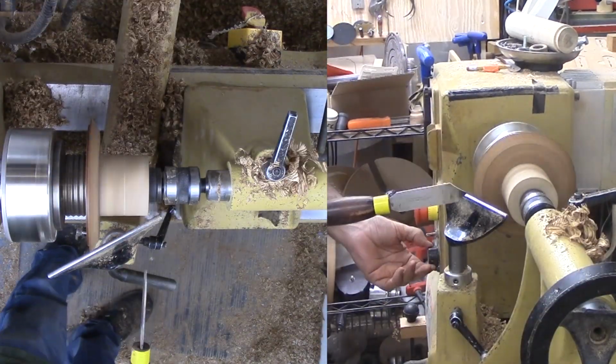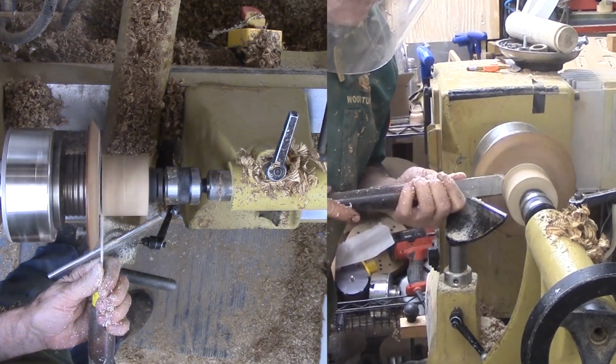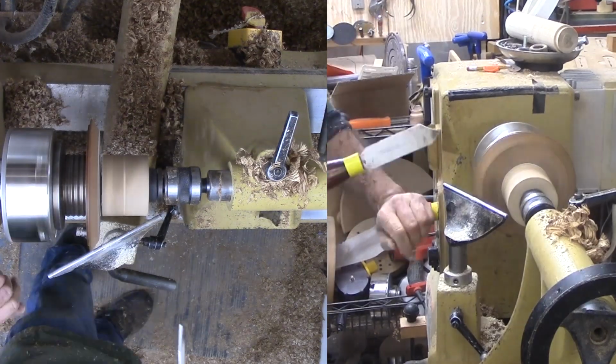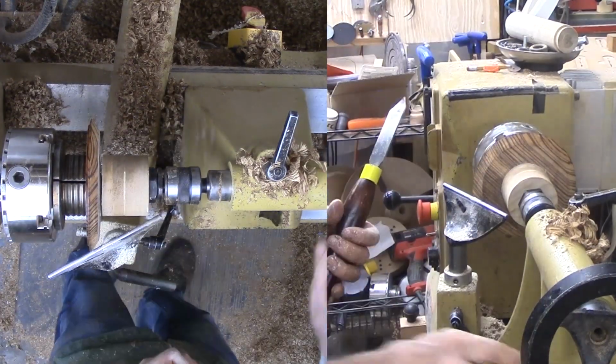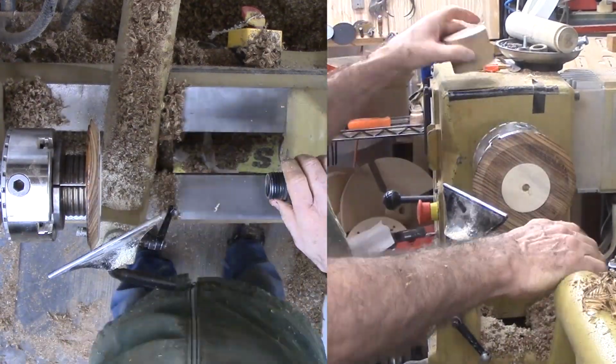With that freshly cut mortise, I can mount the lid and part off the waste block. The waste block is reverse chucked, but I keep the tailstock loose. I do not want it to bind when the wood is cut through. Loosening it when nearly there works great.